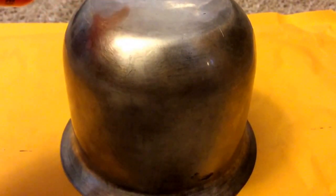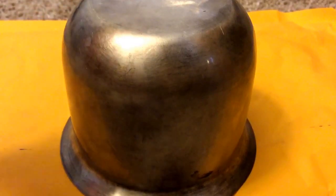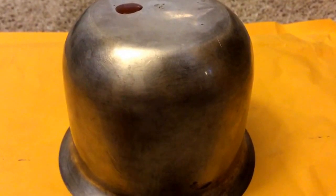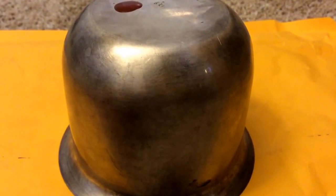So we got some of this acid opened up. It would turn milky white if it was silver. If it wasn't, we'd see a reaction. If it was nickel, we'd see blue. If it was copper, it would just be utterly destroyed — I know from experience. So let's go ahead and check how the reaction is going. What I'm going to do is wipe this after about five or six minutes, and we'll see what it is based on how it comes off.